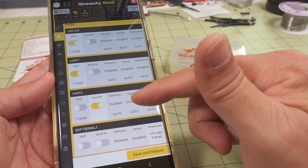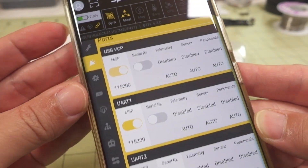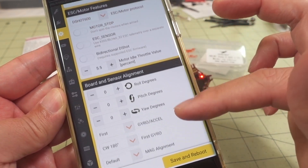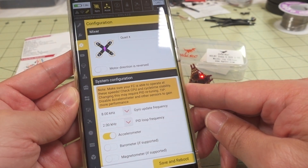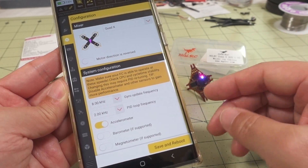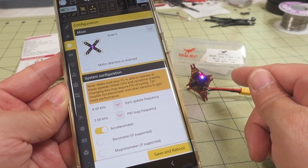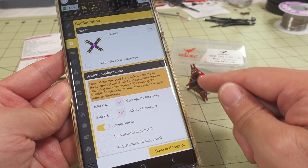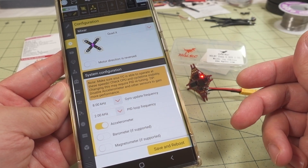UART 2 has Serial RX enabled — that's going to be for your receivers. Pretty much everything else is the same. It shows you battery voltage, all of your settings as you'd normally find on the configuration page. It's just that you have a Wi-Fi radio there to connect to, and you can make all your setup and PID changes via the SpeedBee app without having to use the USB port. That's kind of why I think this is going to be a trend. I'm hoping they'll put this into their 25-amp board and others coming out. It's good to see more options beyond plain USB — I typically like to connect via Bluetooth or something like that, because it makes making changes in the field a lot more simple and easy.